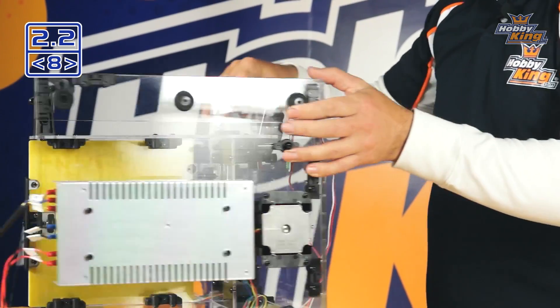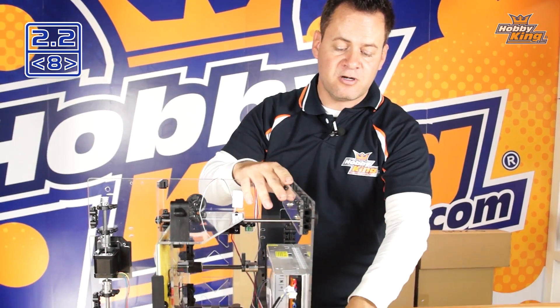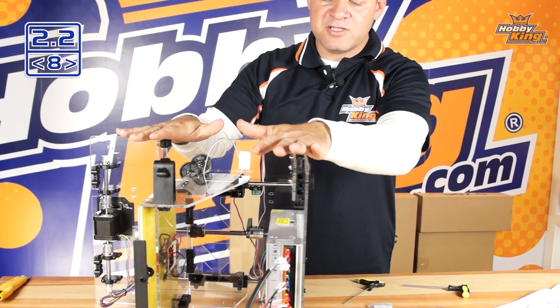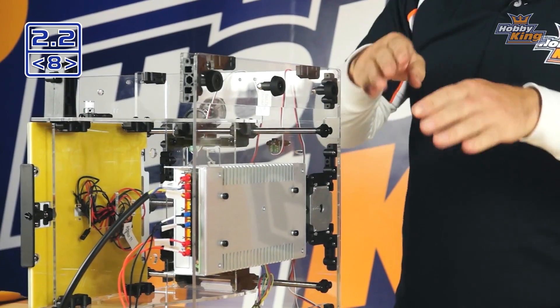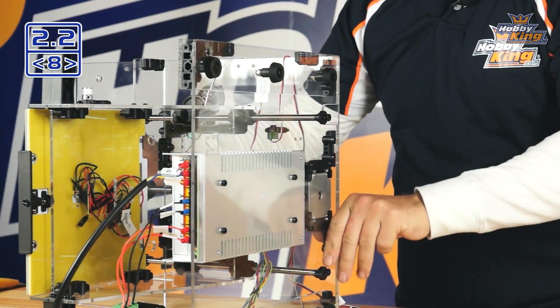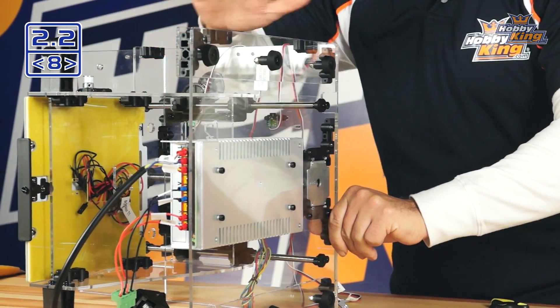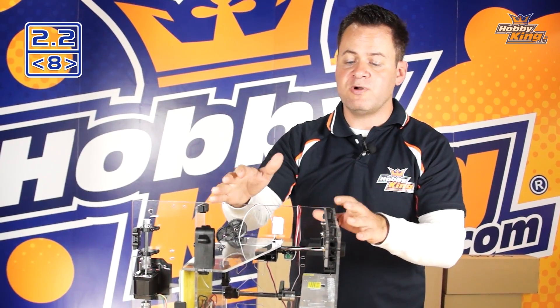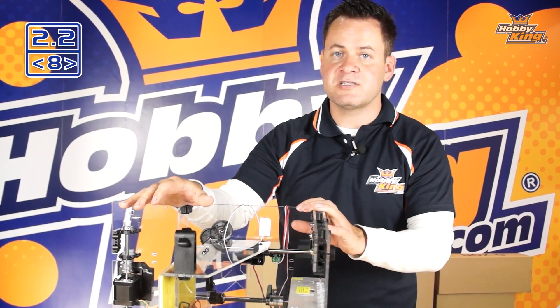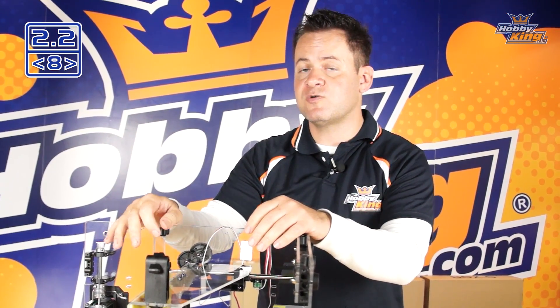Once you're at that point — and you may even want to ask a helper — make sure you're on a nice flat surface. You're going to want to make sure both these components are touching flat so that it's a square tram along the bottom, and push into this so it's nice and tight. The squarer you can get the base plate to the back plate, the rest of the panels and the alignment of all the rods is going to be much smoother and easier to tram later on.